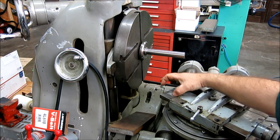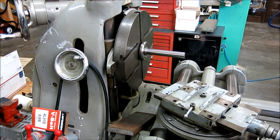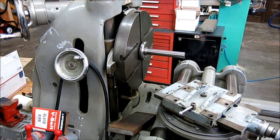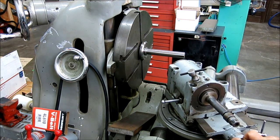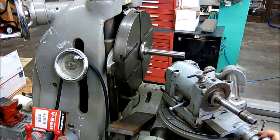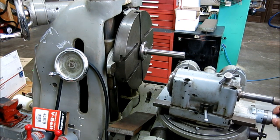Let's pretend that's a shaft. Wouldn't it be nice if we had a tool post here that we could mount a lathe tool? Because what do we have? We basically have a lathe — we've got a compound rest, a powered feed in this direction, and a cross feed this way. It's a lathe. It's a mill. Now with a powered sub spindle, we can apply it to the work and feed it in at an angle or no angle. We can drill patterns, mill slots, drill holes at an angle, mill slots at an angle, and mill prismatic faces that have a particular angle by indexing. There's lots of possibilities here.